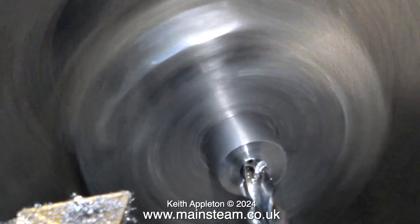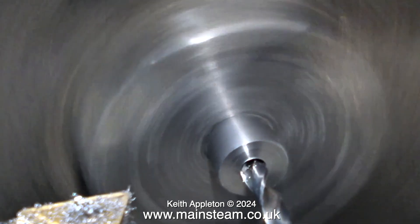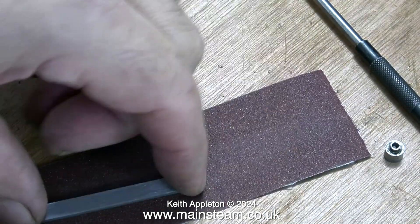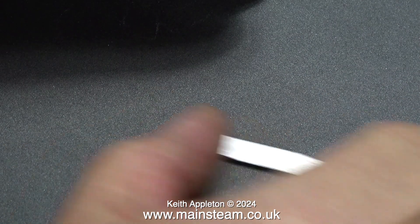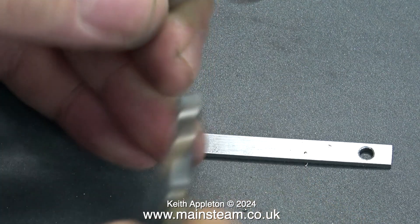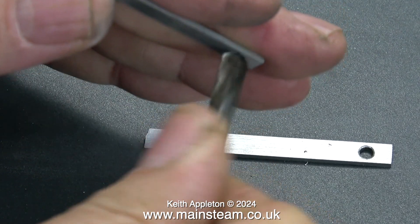Apart from leaving these parts oversize, the original builder did not drill the hole down the center, so I'm doing that on all four of them — starting with the center drill and following through with a number 40 twist drill, which is clearance size for 7BA, the size of stud I'm going to use to hold these parts together. Then I clean them up on wet-and-dry sandpaper and countersink the holes very slightly at one side using a twist drill.